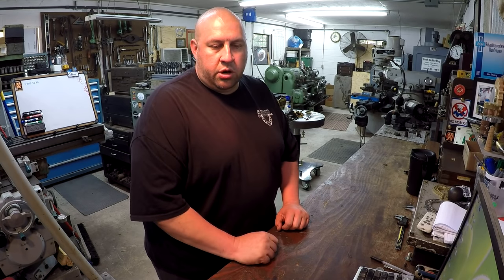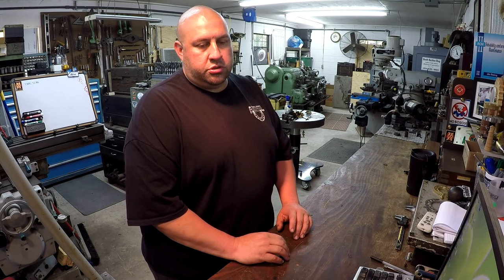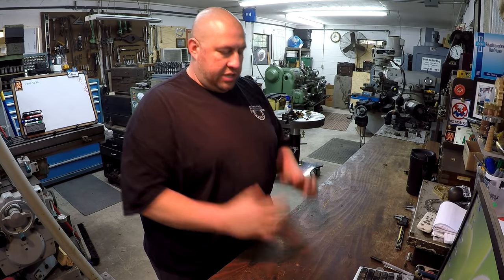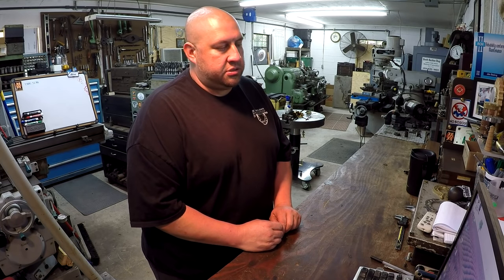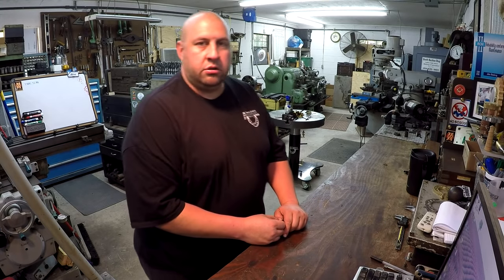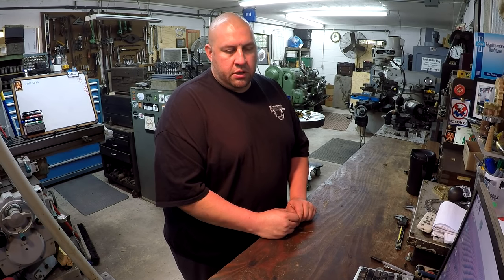And then as I said, today we're gonna show some turning using my Iscar turning tools. One of them is the LNMX insert, and the other one, I believe, is the COMG insert that I got a few months ago. I did a test video. Well, I took that down there and I got this 8-inch diameter 4140 shaft that I'm having to machine for one of the gearboxes. I started that this morning, so I took both those tools so that I could make some heavy roughing cuts and get a little video for the channel here. I think you guys will enjoy that, get to see some chip making. So I'm gonna throw all those clips that I took at the end of the video here.